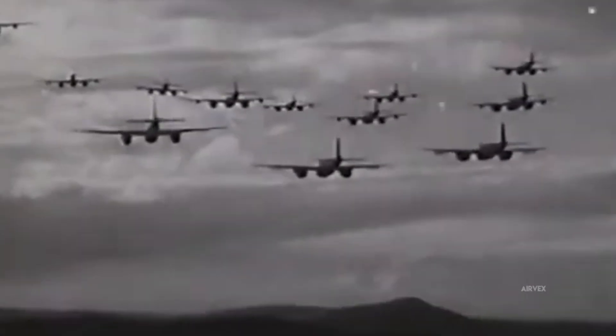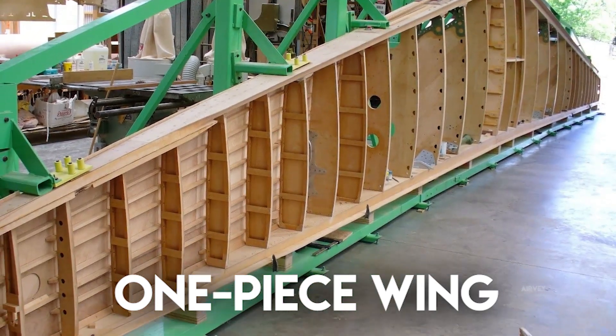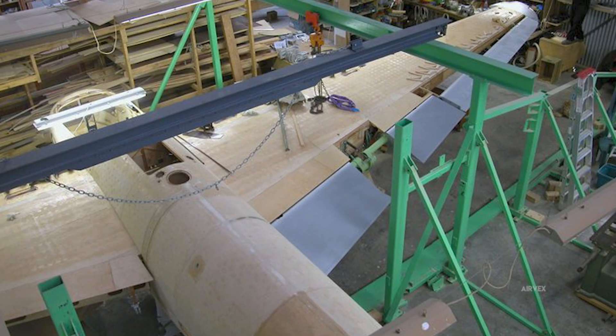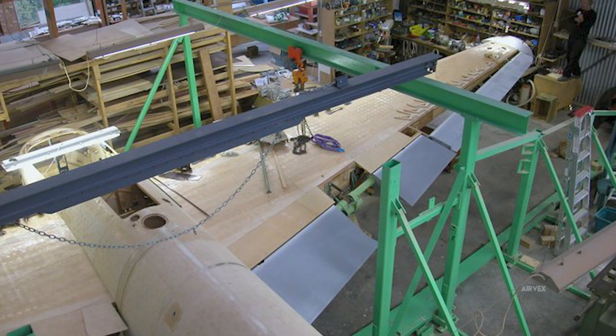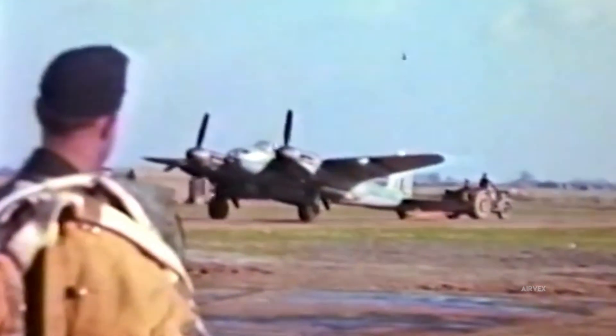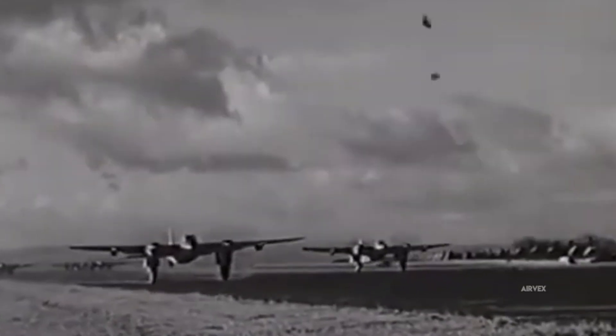The continuous one-piece wing, built from spruce spars, plywood ribs, and stringers, eliminated mid-span joints for a smooth aerodynamic surface, minimizing drag and optimizing performance above 400 miles per hour. Precise V-groove bonding and lap strips integrated the wing and fuselage seamlessly, ensuring efficient load transfer during high-G maneuvers. This wooden structure achieved approximately 30% weight savings over metal designs, though it necessitated rigorous moisture control and meticulous maintenance to prevent environmental degradation.